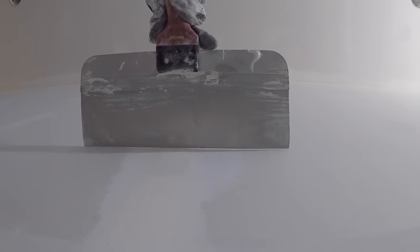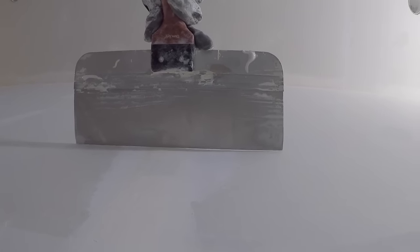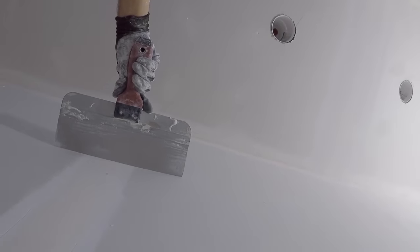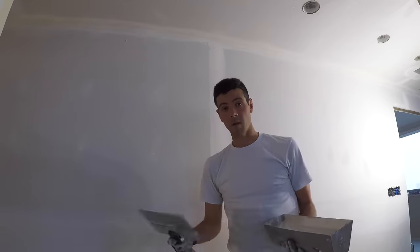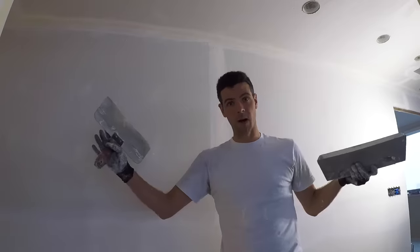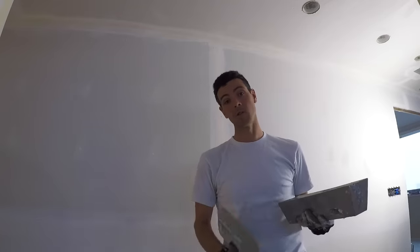This one is a lot more like your typical butt joint — as you can see, it rocks, which means it needs pretty good fill on either side. It's not so bad at the top. Now comes the very particular job of coating this thing, and I'm very specific about how I like to do these. I'm going to go one foot wide on each side of this joint because it's not a huge one — it doesn't need to go three feet wide. This will be settled in a two-foot joint.